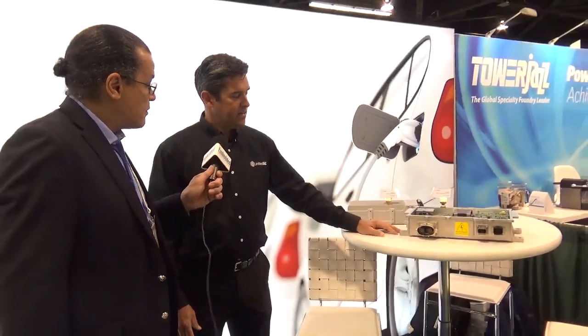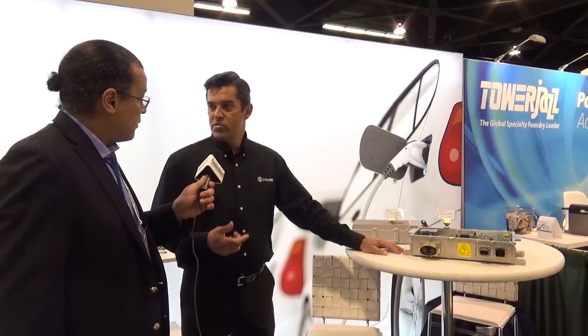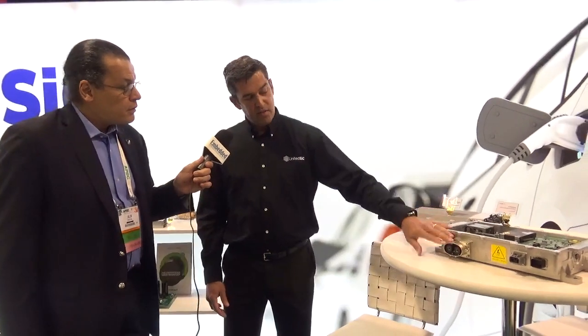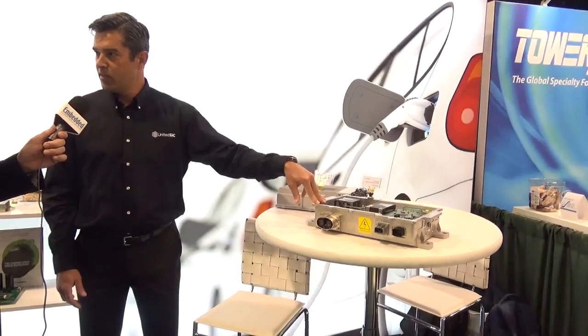I also see some big devices over here. You pick which one to talk about. As we've been saying for the last couple of years, maybe a couple of PCIMs ago, you were asking what was driving the business. For us, it's been automotive, particularly onboard chargers and DC to DC converters. We have an example here from a customer in Korea that builds these DC to DC converters for Hyundai. It's a high voltage input, low voltage DC output that incorporates our 1200 volt 40 milliohm devices. They have a smaller 3 kilowatt version that uses the 80 milliohm parts.